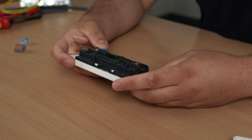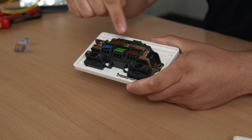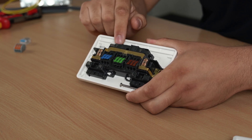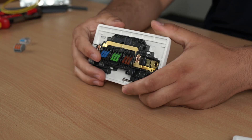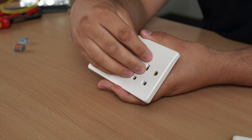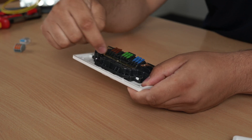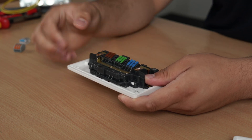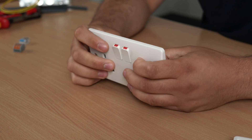There are also a few other points labeled on there, such as test points. These give you a point from which you can test. So when you come to installing this, if you've dropped it forward and you're not using an adapter, you can lean it forward and use your test probes in those test points — because obviously you don't have any screwed connections to probe onto. They've incorporated test points at the top, which is a really good feature for this type of socket.